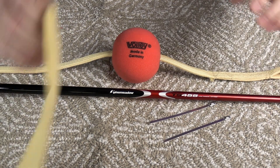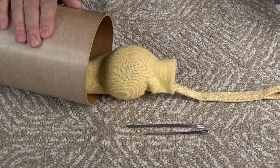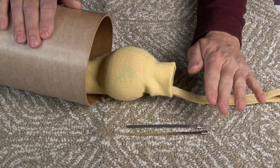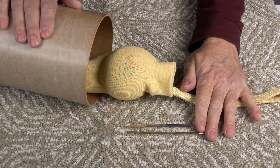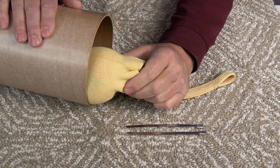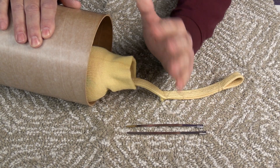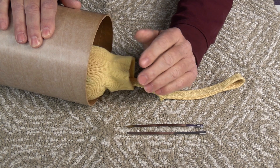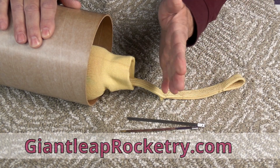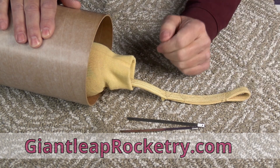Next up, I'll put the sleeve on it, and we'll talk about the stainless steel straps in just a minute. I have folded in the edges of the Kevlar sleeve according to the directions, but I have not put the stainless steel straps on yet. What you want to do is adjust your fireball so that only one-third of it is on the outside of the airframe — when it's positioned like that, it's done properly. Then you can go ahead and put the stainless steel straps on, and you can adjust the fireball up and down the cord as necessary to get that optimum position.